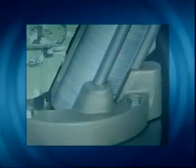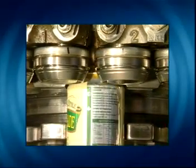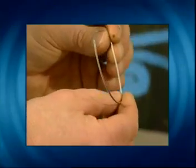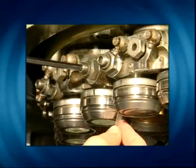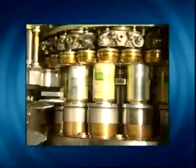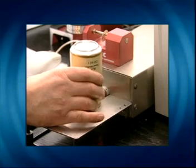Since the introduction of 202 diameter, the industry has reviewed the double seam specification in relationship to improving seam integrity and reducing iron pickup. The basis of seam acceptability relies on the double seam meeting the critical parameters of seam thickness, tightness rating, actual overlap, body hook butting, and seam gap. These minimum requirements must be maintained under all conditions.